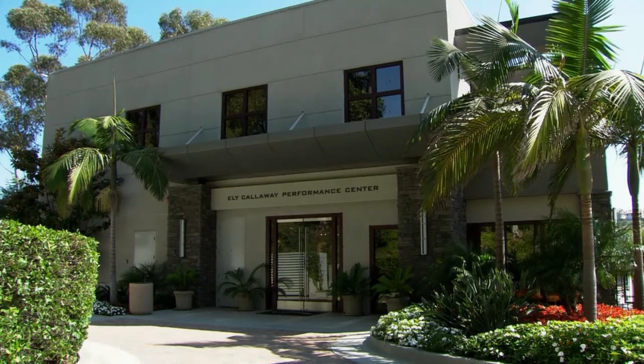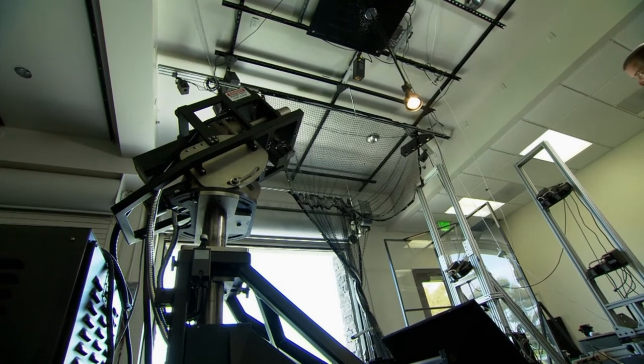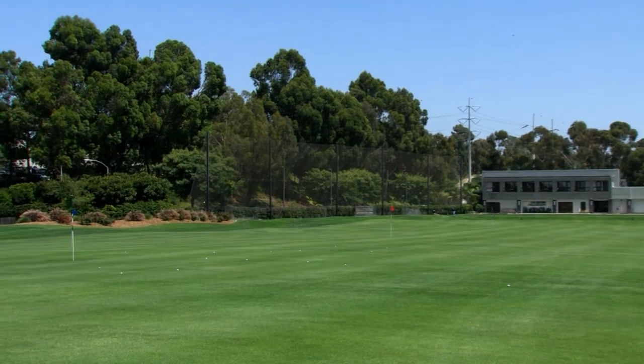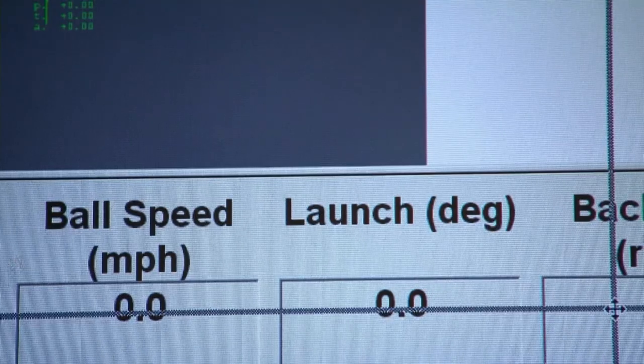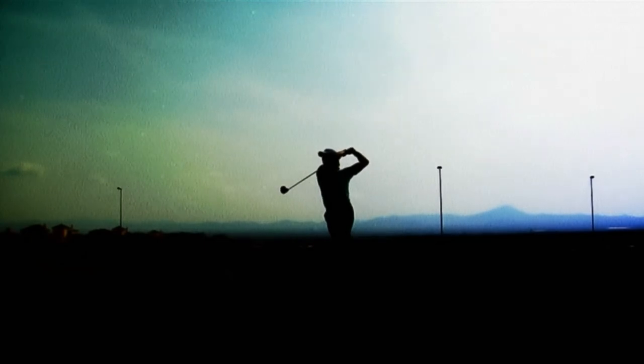The molecules are like a spring, and that's the difference between different grades of polybutadiene. With some polybutadienes, they're very linear and they're very efficient springs. Designers at Callaway's Tech Center in Carlsbad, California, measure the spring of their rubber formulations by having a robot named Big Bertha whack golf ball after golf ball with a consistent force. A technician measures and analyzes the results.